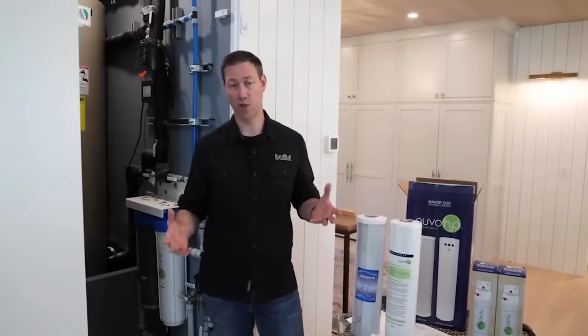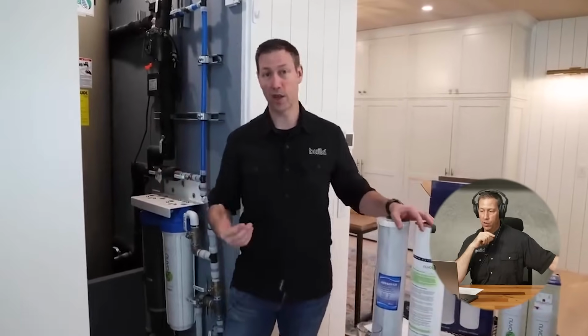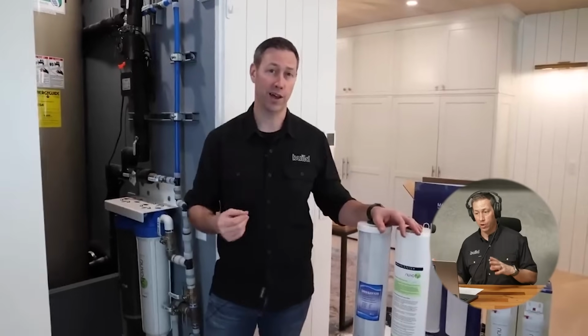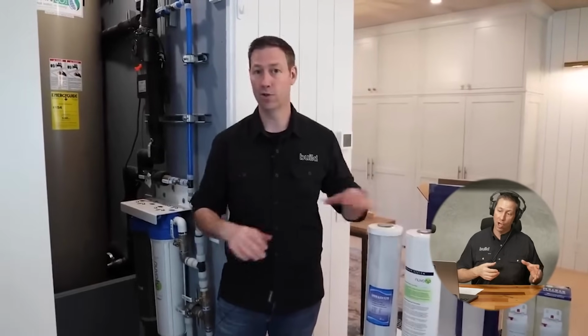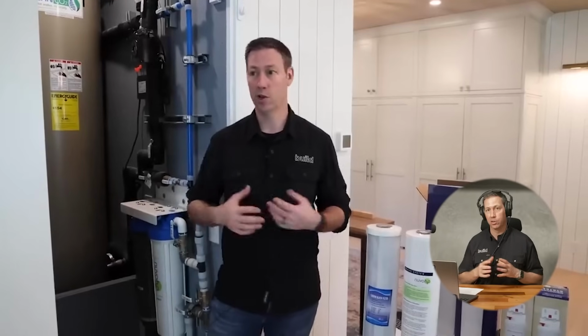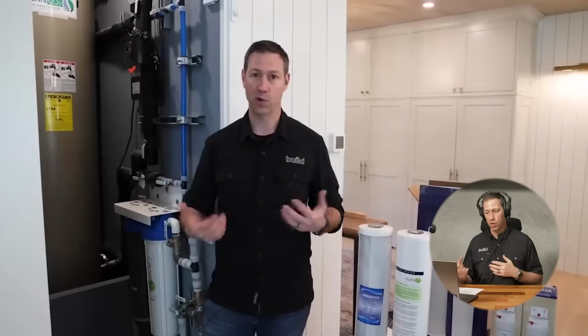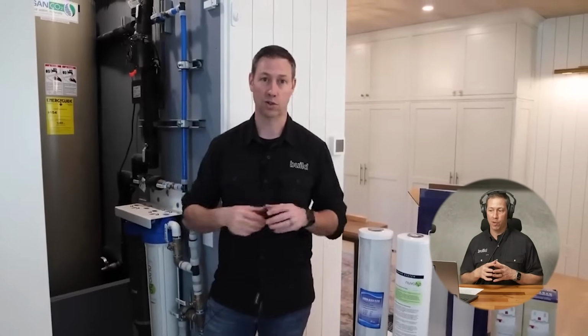I do want to spend a minute, though, on this water softener system. I published this video, and I got to tell you, it's been a really controversial video. Nuvo H2O, they call it a water softener. Many of the comments said it shouldn't be called a water softener. It should be called a water conditioner because it doesn't use salt. It's a citric acid based system which prevents scale formation.